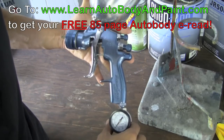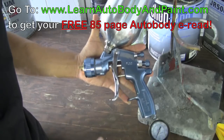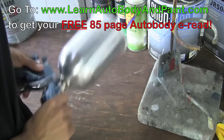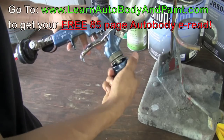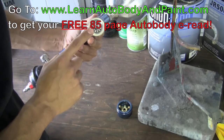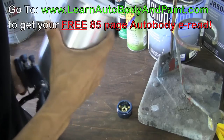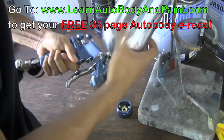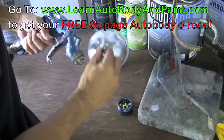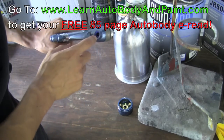A few things about cleaning: you want to make sure you take the whole gun apart and soak it. Have a little bucket filled with lacquer thinner. The front comes off pretty easily. You'll have a little wrench that comes with the gun to take off the tip and soak it. Also, don't forget to take out the little filter in the neck of the gun.